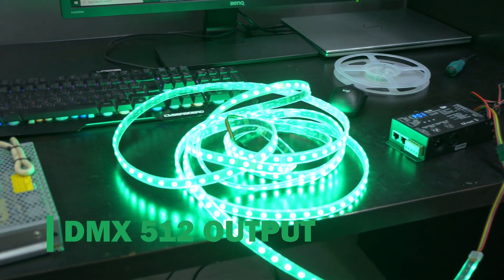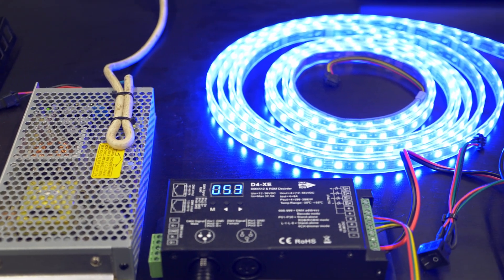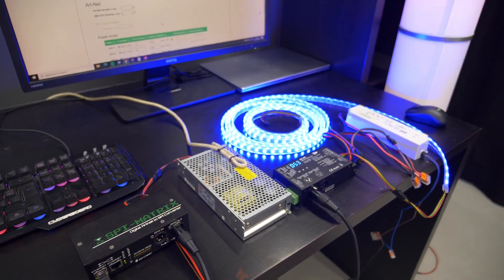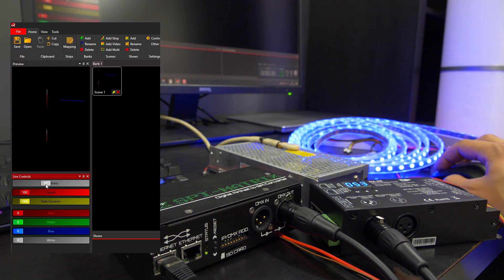Sometimes we still use good old-fashioned RGB LED strips, that's why you can use the DMX output to drive DMX LED dimmers. What's great about it is you can use this DMX output along with the digital SPI outputs even in standalone mode playing animations from an SD card. Basically all you need is one SPI Matrix device to control both digital and RGB strips.